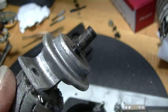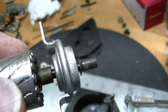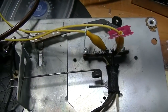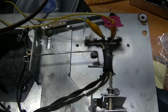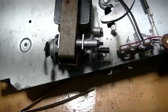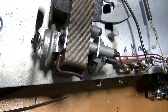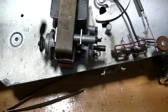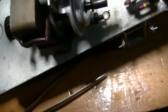The other end doesn't look like it's going to come off. In that case, I'll have to clean and lubricate as best I can. I'm ready to test the motor. If you do something like this, you have to be really awake because there will be 110 volts here — that's a good way of getting a bad shock. Well, the motor is moving, which is great. It looks like it's moving slowly, but that's a stroboscopic effect with the overhead light and my camera — it's actually moving very quickly.